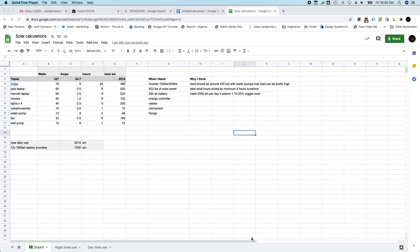The first thing you'll need to do is find your solar panels, but you'll come up with the question: how many solar panels do I need? So you have to start with a little bit of maths. Go through every item that you think you'll run on a day-to-day basis and write them down in an Excel spreadsheet. Once you have them all written down, go on the internet and find out how many watts that item uses. Sometimes it'll be written on the back of the item, sometimes on the internet, and if you can't find it you might have to buy a watt testing meter.